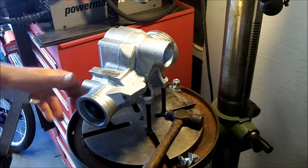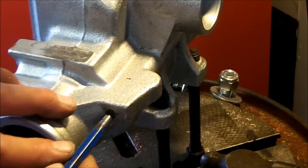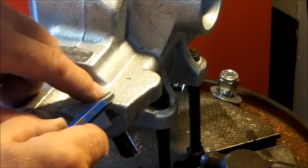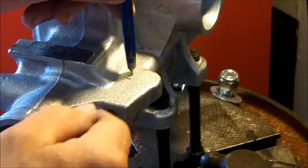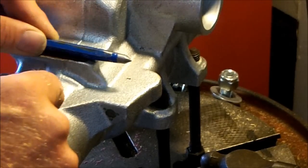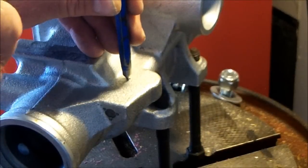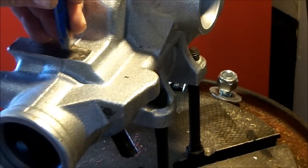On your other hole, you're going to use this cap that they put in as your center line going down to here. Just eyeball it, and it does not matter this way so much. You can pretty much line them up with the one that you're using here — I'm actually off a little bit, I'm a little further south. Then center punch the other one.